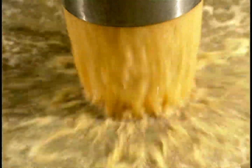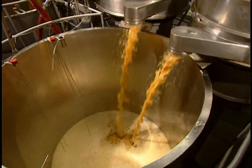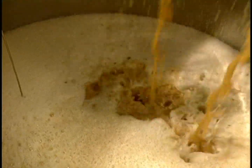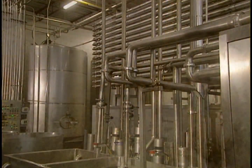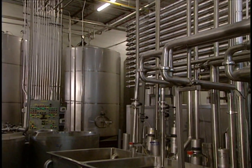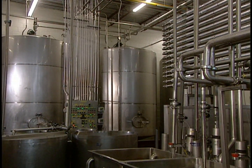The fabrication process continues. Juice flows from one stage to another via these immense reservoirs. The next step will be pasteurization. Juice enters this exchanger at 72 degrees and is heated up to 190 degrees, then cooled back down to 122 degrees.